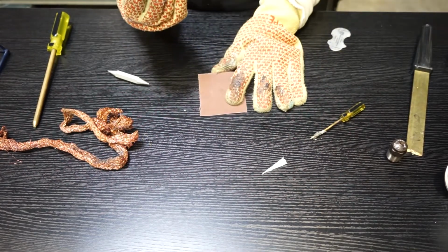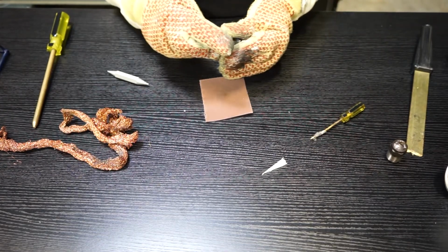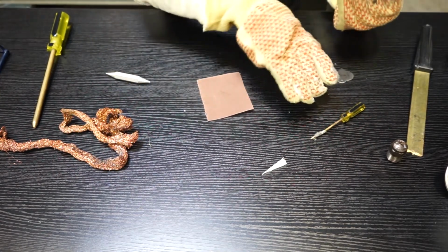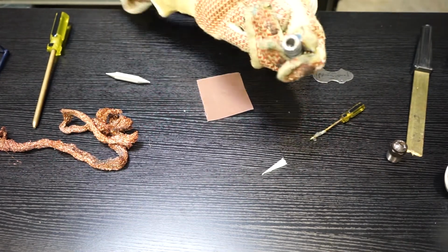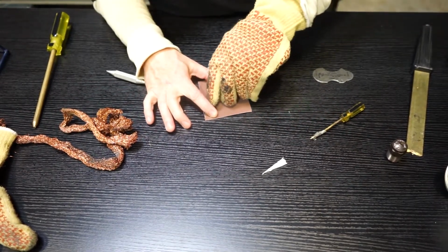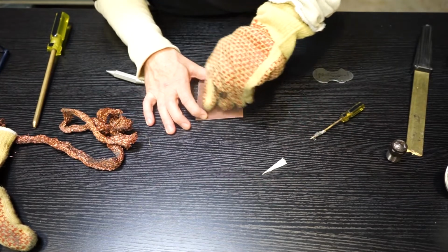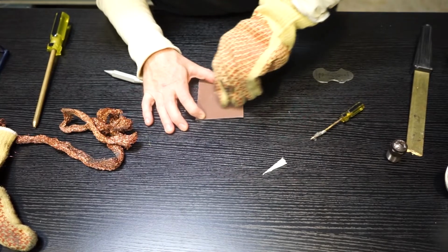One important thing is to make sure that seat is perfectly flat and there's no dings or low spots on it. So after I check the radius to make sure it's correct, I have another video on how to use this nozzle radius gauge. You want to get some emery cloth and put it on a very, very flat surface, probably flatter than this table. A good piece of granite or marble would work in your tool room, and just re-flatten that seat so that it seats really well against the seat inside the nozzle body. Very important step. This cleans any dirt off. You're going to use a low grit, like 600 grit emery cloth.